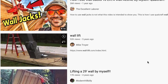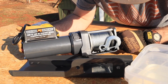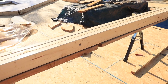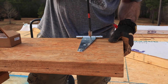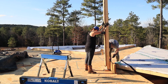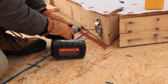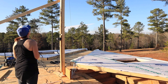I wanted to try the winch, so we went out and bought a $150 winch from Harbor Freight with a max lifting power of, I think, 1,500 pounds. We got a heavy-duty pulley and stacked some lumber up to make a giant 16-foot post. We ran the winch around the pulley and got some hinges, fastening the bottom so it could pivot, making sure that bottom was secured to the floor joist below. Then we put a good-sized D-ring on the top of the wall, and lo and behold, we had ourselves a wall lift.